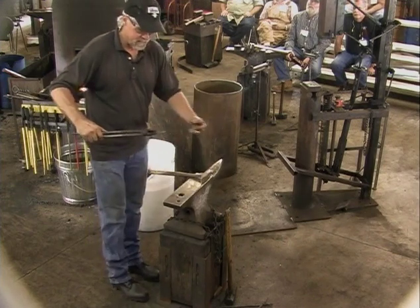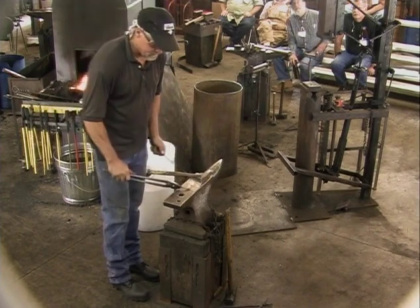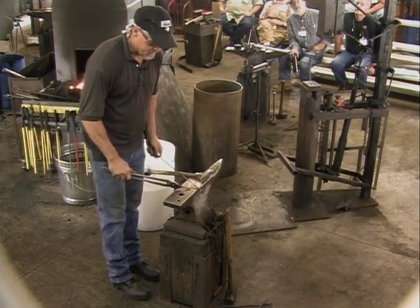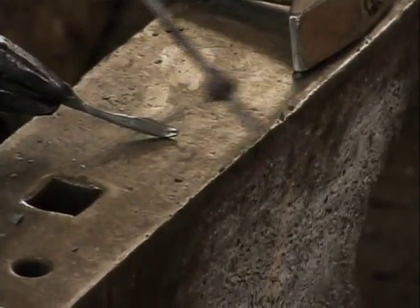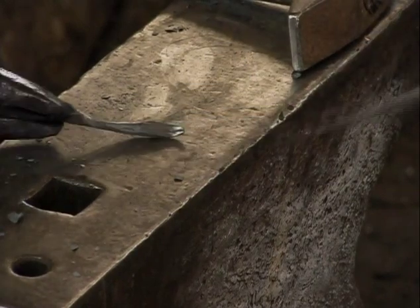So bringing that to a sharp point, not just thin this way, but that way, I'm sorry, makes this blend in. If things work out right, it causes the tip of that to weld into the stem, hopefully in one heat.